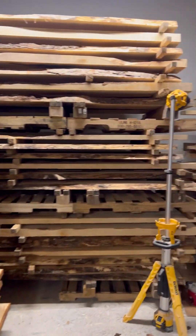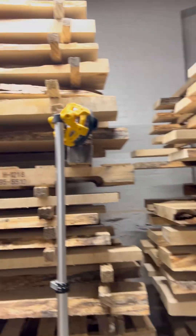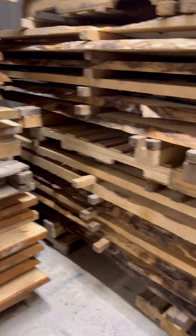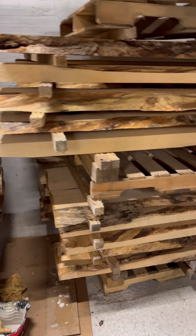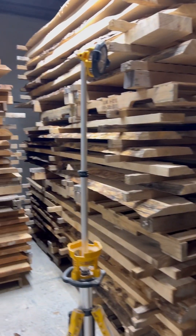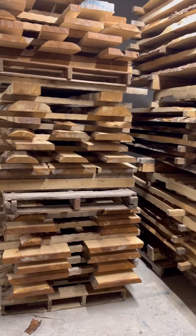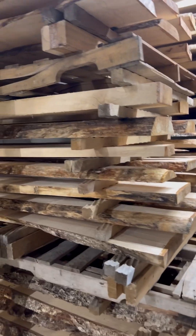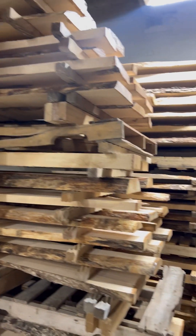What you're looking at is highly figured Eastern maple — a combination of hard maple, bird's eye, blister, curl, soft maple or red leaf maple, and curly. Beautiful, beautiful stuff cut in 7-quarter, which is 1.75 inches, and also 12-quarter. Those two sizes are ideal for cutting guitar parts and it's universal — we can use it for other applications if need be.